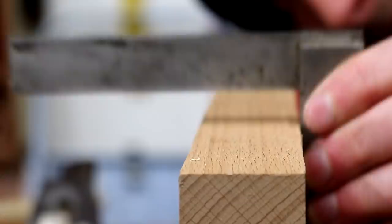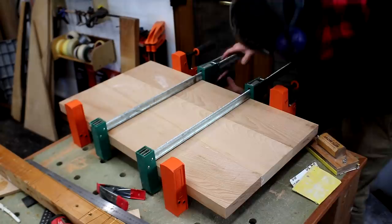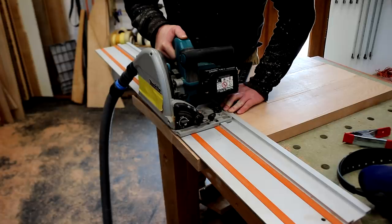What I did was glue up just the two pieces that joined together nicely, and I wiped the glue off the third piece. Then the next day I worked on squaring up that edge with my hand plane. It was only a tiny bit off, but after taking a few shavings it joined together nicely. So I got that third piece glued up and just checked it was flat this time — it wasn't perfect but it would be good enough with some sanding.